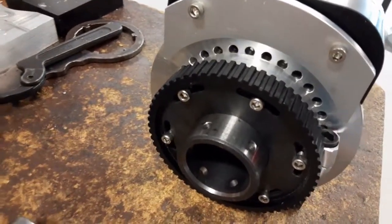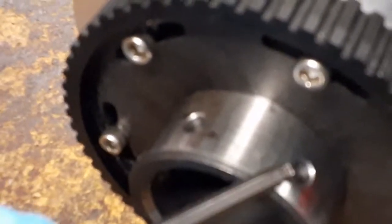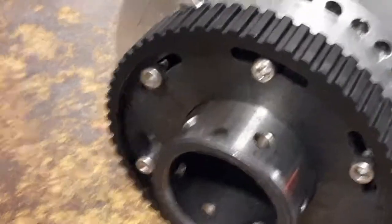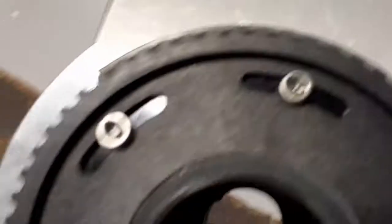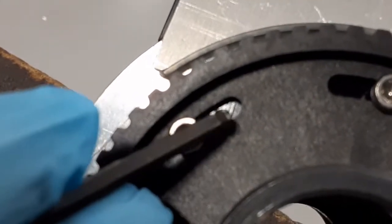What we did here was we took it apart and added some more holes to the shaft. We've got a total of six holes so that when this thing is rotated, we should be able to pick up two or more of these holes to loosen it or tighten it. We also elongated these slots — these holes — on the bolts that hold this onto the aluminum piece.